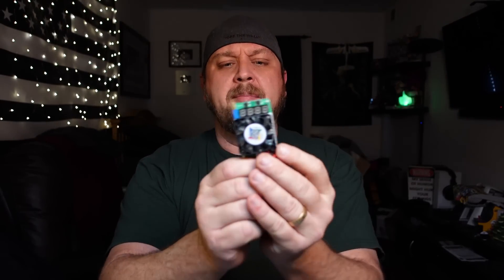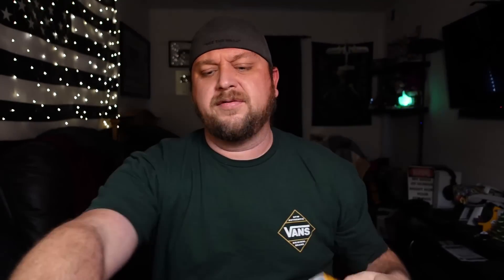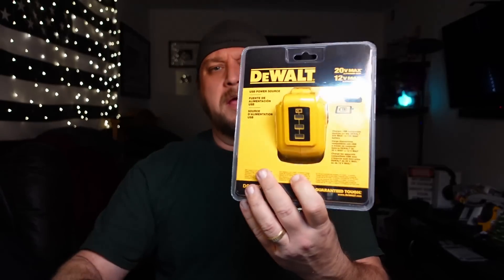The reason I bought this is to check battery capacity. You plug it in after the battery's been completely discharged, let it charge up, and it will show you how much capacity you put back into the battery, letting you know how much capacity the battery actually has. It's also good for checking if your battery is starting to get tired, because as they get tired they take less capacity. You can also test if the output of a charging device like this Milwaukee or DeWalt battery charger actually works as a USB charger and puts out the amps they claim.